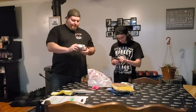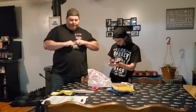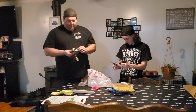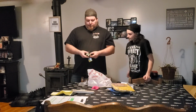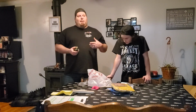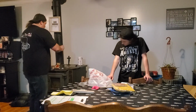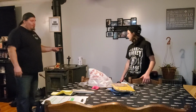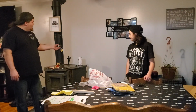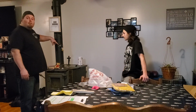And then got this cool little tool, came in the mail today. This is actually from Strong Hand Tools. I've seen these for a while, but never got to play with one. So, what this is, it's got magnets on these flat surfaces. It's also got magnets on the side. The way this works, if I'm going to weld a tab onto a cage, or if I'm going to weld a tab onto like the core support I plan on making for the S10, this is what I'm going to use this for. So this thing will actually position itself. I can set a level on the bottom of this, or I can set a level on the top. Any angle I want this bracket to be, I can position this thing and it's going to hold it. Then I can set a piece of metal on these magnets and it will actually hold it to the surface.